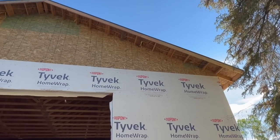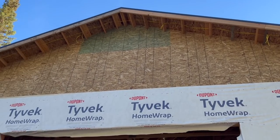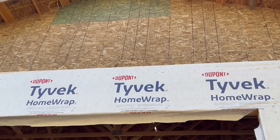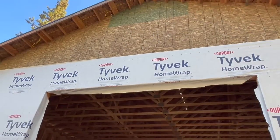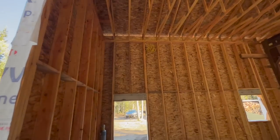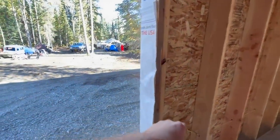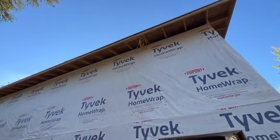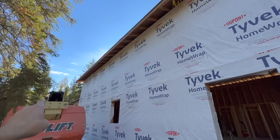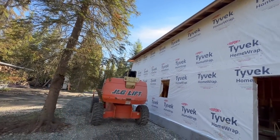Okay, so here you can see on the outside of the building, this is where we stubbed out for our soffit lights. We also got our yard light poked out. Barely see it. Poked out right there. And over here, we poked out right here. Just like all the other ones, that'll drop straight down to the switch that we're gonna put right here. We're gonna have a covered RV parking area here, so we poked out one wire for lights under the covered area, and then one wire will come over. It'll be 2 yard lights that shine out this way towards our woodshed.